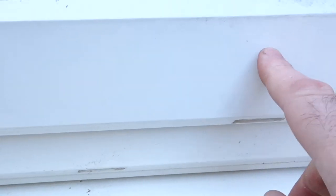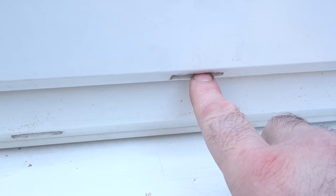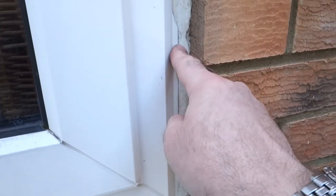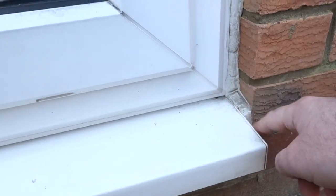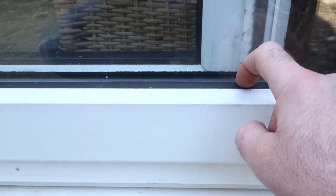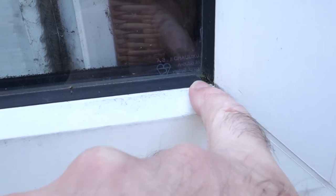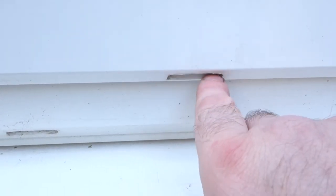Even on the fixed panel there's also another drain to let moisture out — something to bear in mind. Also, while you're here, just make sure any caulking or mastic sealant is intact, because over the winter you'll be surprised what sort of damage occurs. Make sure your gaskets and any seals are intact, and if they're starting to show signs of perishing, get them changed. This one here is just starting to shrink, and what that does is any moisture that gets down there will exit through here — so these have to do their job.